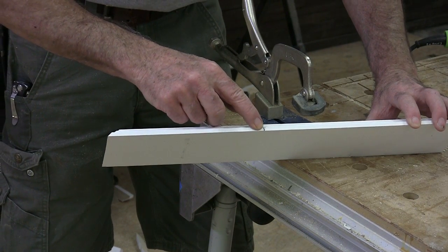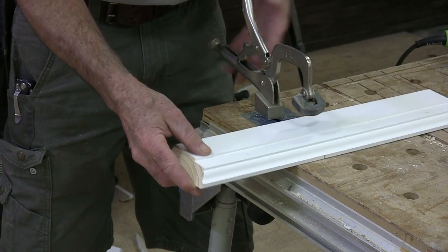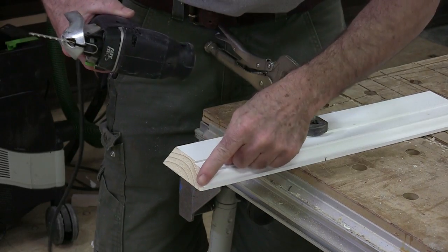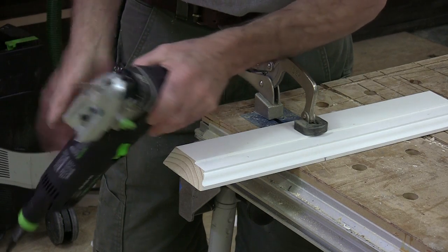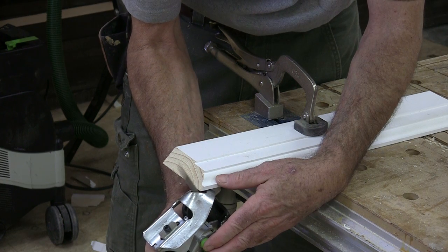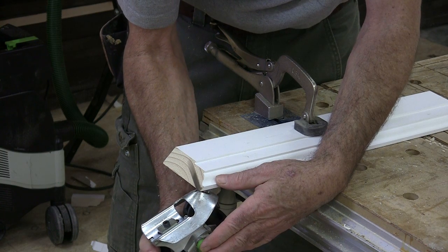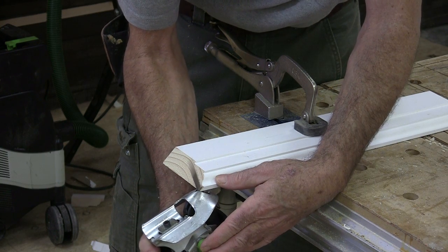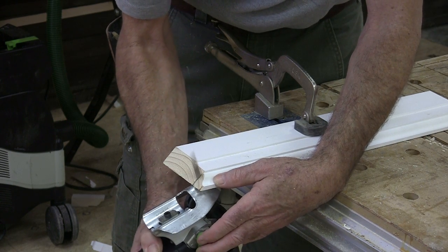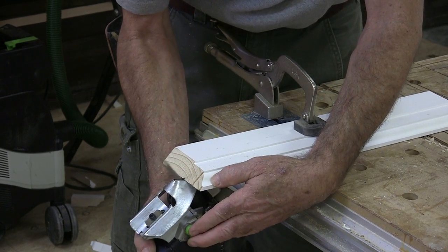There's that measurement mark I'm going to make that butt cut at. And here's the little cope on that little short piece, so I'll clamp this one down. I like to make that little overlapping miter first, so I'm going to cut that right away. I'm just going to lock the tool up into the molding. And now I'm going to come down here and do the same thing. I'm going to lock the tool up right into these two fillets. Here's the second fillet.